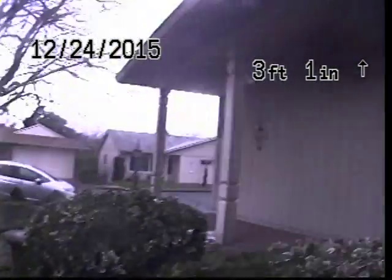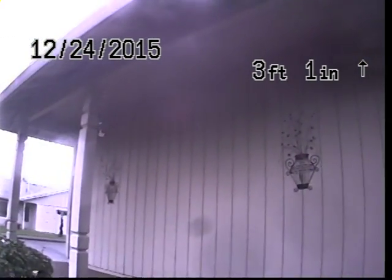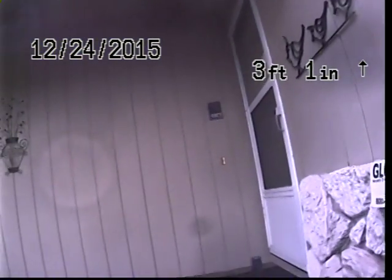And as you can see, we're out in front of the home. Our sewer cleanout is just to the right of the main entry. There's our front door there. Let's bring the camera all the way around here to the ground. Our cleanout is a 3-inch ABS line, which is a modern plastic. I'm going to go ahead and drop our camera in there and see if we can get it pointed in the right direction.